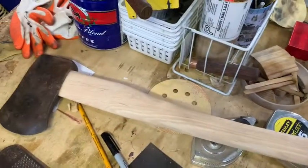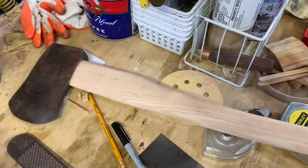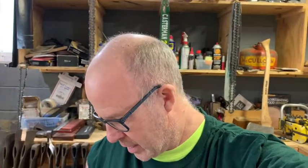With a store-made handle, it's not terribly critical because, look, we're already in. If you've got a ready-made eye and you're just taking enough off to get it to fit, you don't even really need a draw knife. Spokeshave, same thing. Some things and grains of wood, the spokeshaves work great, and others, the grain gets squirrely running in two different directions on the same side, and that can happen too. And you shank off a big piece and you've either ruined something that you've been making from scratch, or you ruin a $30 handle or a $50 handle or an $80 handle.